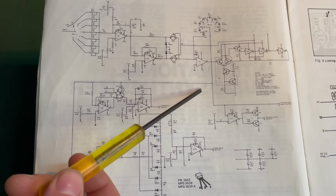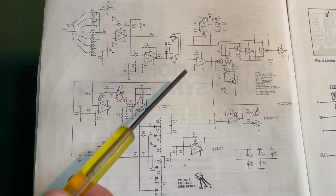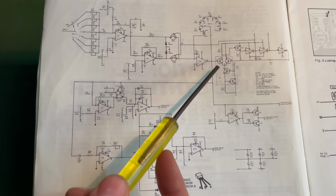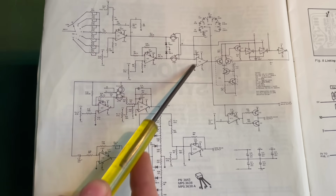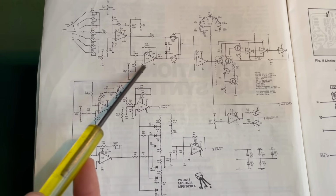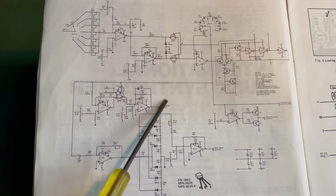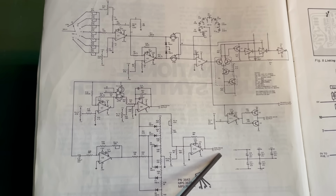As is pretty common with analog synthesizers like this one, this has triangle core oscillators. So that means that the triangle wave is what's generated first, and then all of those other waveforms are derived off of that by shaping it in different ways. So here, this section, this is generating the triangle waveform. Then down here we have a little circuit that transforms that into a square wave. This bit here transforms it into a sawtooth output, and down here we have the sine wave.